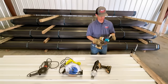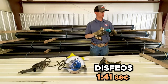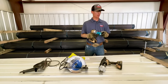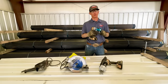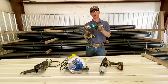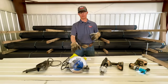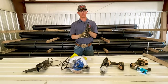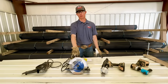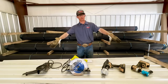The last tool came in at 1 minute 41 seconds — definitely the longest — but it chipped off little fingernail shavings to get through. The valleys slowed it down; on a straighter, smoother piece of tin it would fly through, and for circles or curves it would be really handy. Overall, I would go with the skill saw — it flew through in 25 seconds. If you're cutting on the ground before putting it up on your metal building, get a nice table and support it. You could probably cut three to four sheets in 25 seconds. Super clean cut. Go with the skill saw, but you've got a few other great options too.